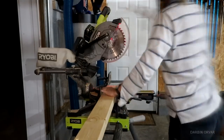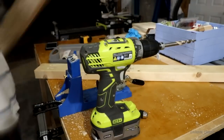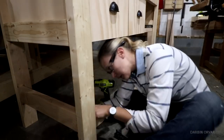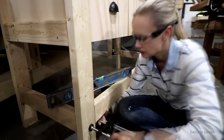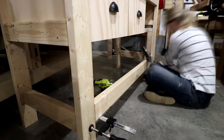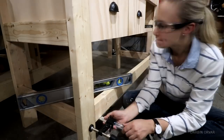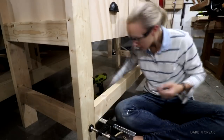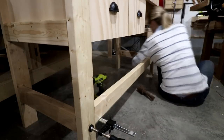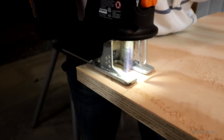This last part I'm working on is a shelf for the bottom of the workstation. Since this piece is higher and more narrow, you don't need any leg space underneath because you're going to be using it standing up, so I figured I might as well add a shelf under there for more storage. Just cutting up some 2x4s to length. It's also nice because it really squares up the piece as you secure it and gets the whole unit even more solid. I'm also notching the corners of the shelf so that it fits perfectly inside.